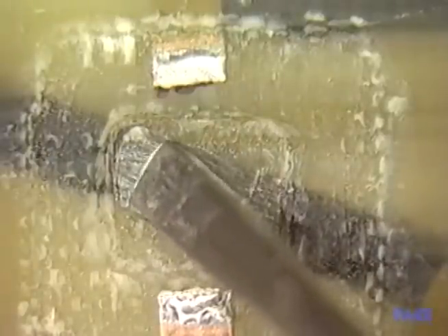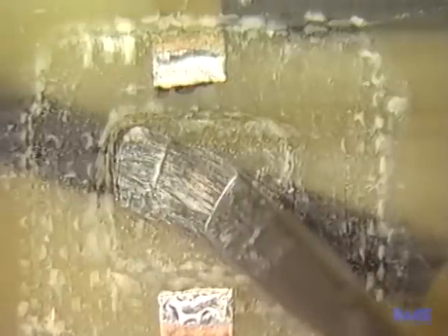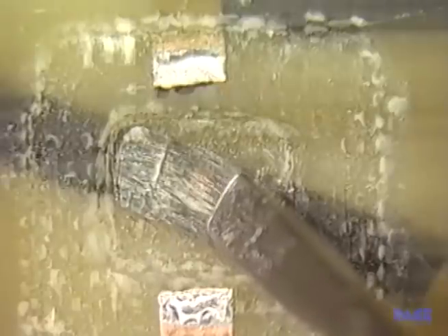Before applying the epoxy, burnish the repaired conductor. Here a bit of exposed copper is showing — in this case, it's all right, we're going to be encapsulating it anyhow. Now, smoosh the epoxy into the rounded corners a bit. Use the double-end explorer to eliminate the air bubbles by moving them right over to the edge. If we don't get them all out, they may outgas in space after the epoxy cures and that can ruin our job.